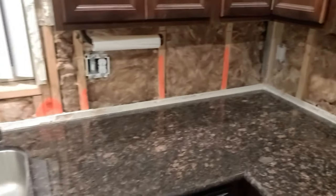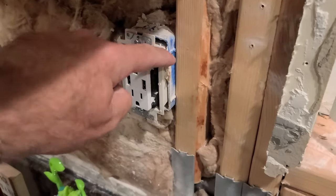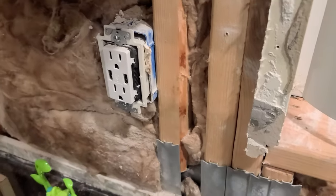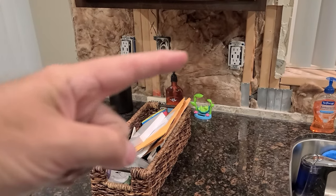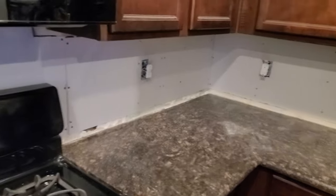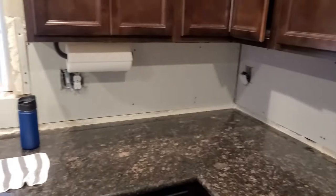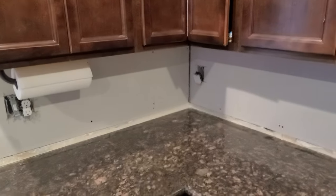There's all the drywall out — nice slow pan all the way around the kitchen. Before I put the drywall in, I have to take all these box extenders out because we had tile. It's just a matter of taking these two screws out, flipping the plug out, and pushing that back in. If you're not comfortable doing electricity, get a licensed electrician. I have a video where I replace these two switches right here — I'll put a link to it. All the drywall's done. It's not the prettiest in the world — if you want to see pretty drywall, I'd recommend you follow the Vancouver Carpenter. I'll put a link to his page in the description. Now I need to get some mud and tape on these joints so it can dry overnight.